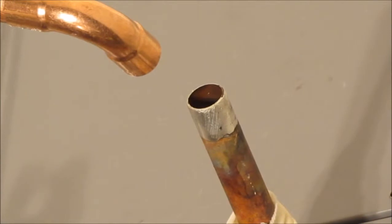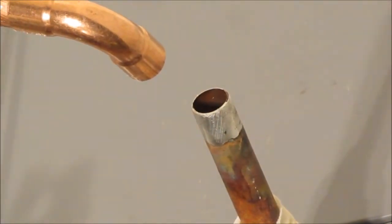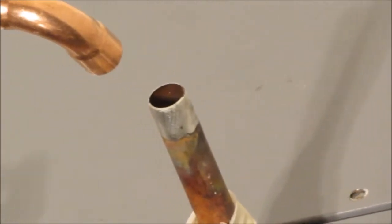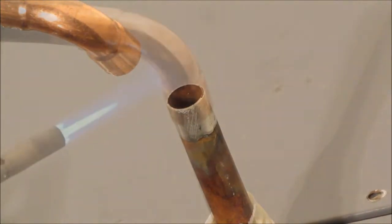And I've got some rags protecting it. I really don't need the one on the air handler side. I got a rag on there anyway, but I don't need it because the pressure bulb's not connected for the TXV valve. So let me get on up the ladder here.